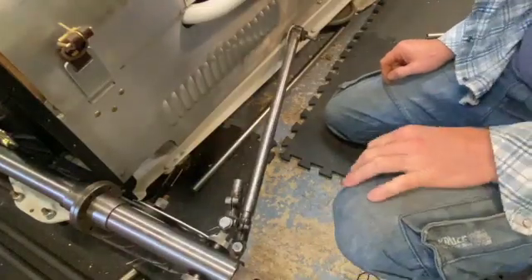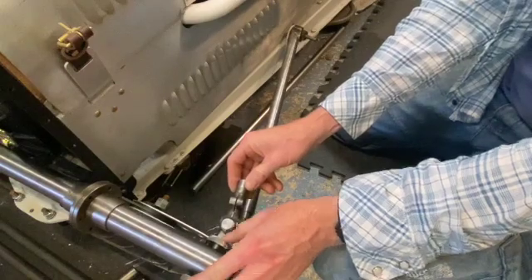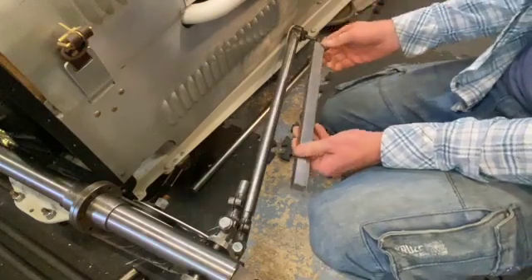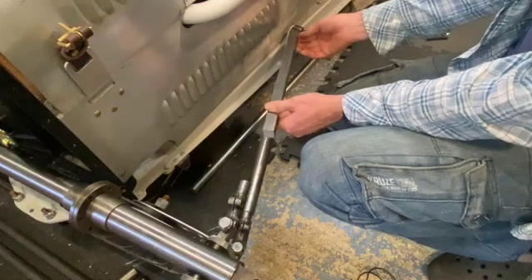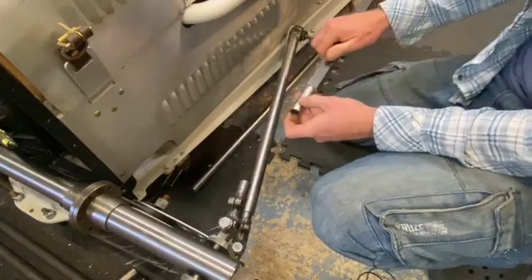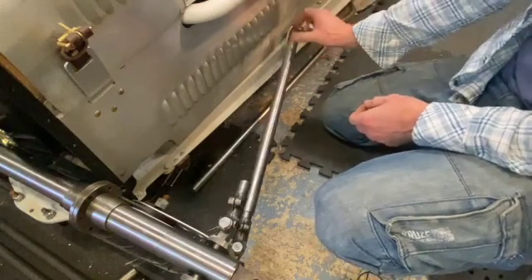The plan is to make a link which connects this top piece — which obviously pivots backwards or forwards but needs to be held still — back to here. What I've got is this square section bar and I'm going to machine up a sort of connecting link, which is only going to be about that long. It's going to slot onto some tube like that and then be welded together, forming a pivot at that end. That's the first step: make that part.